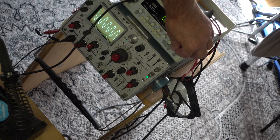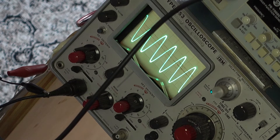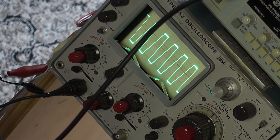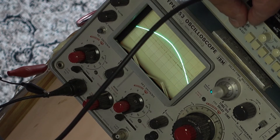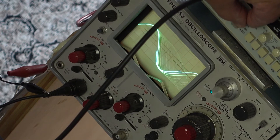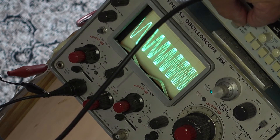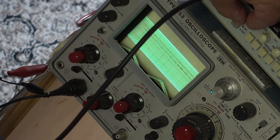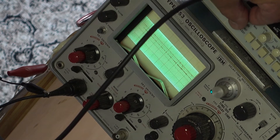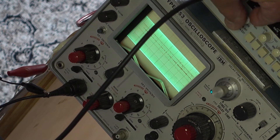If I increase the input it goes to about 85 volts, and that starts distorting - very symmetrical, nice distortion. It just cuts up and down the waveform, very nice. If I sweep the frequency, you see it's 100 Hz now, exactly the same amplitude.